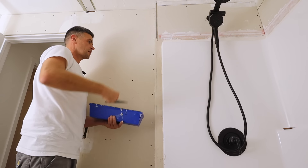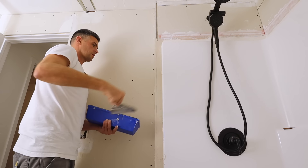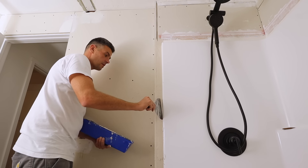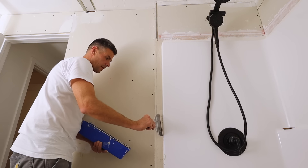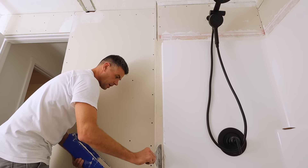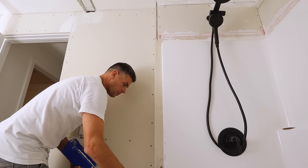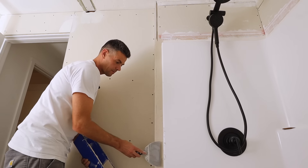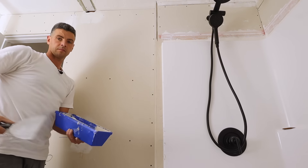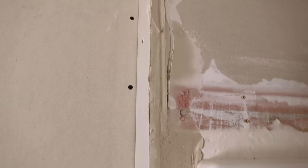Just make sure you don't have any big lumps. You can also sand or scrape it down when it's dry or set, but the tidier you have it right now the better. Be gentle on the flange so you don't scratch it — they're fairly resistant but not totally. So here it is, as you can see it's filled in and flat-ish. We're just trying to create a solid surface there. We'll let that set up before we move ahead.